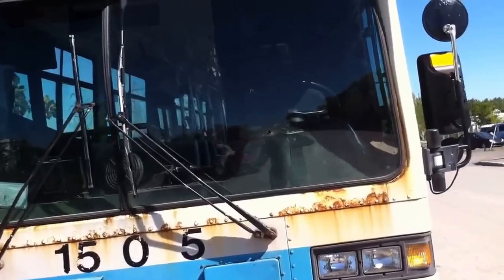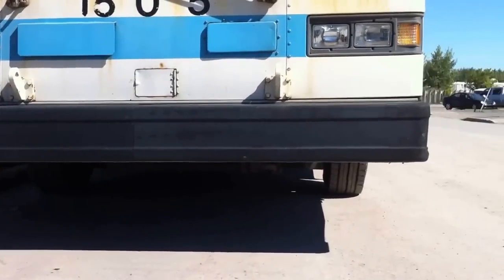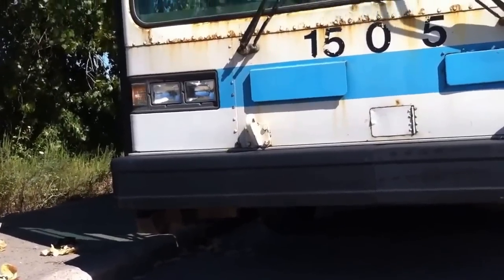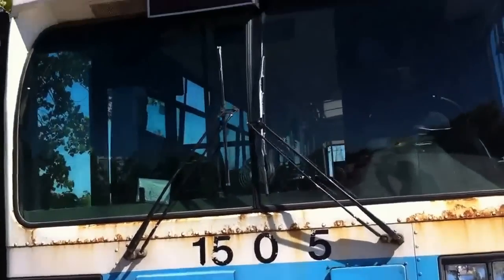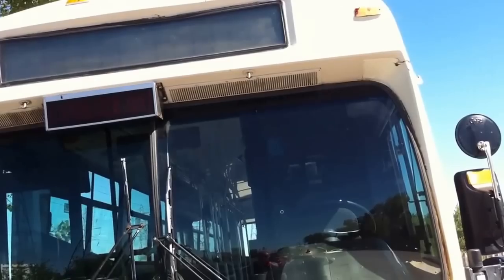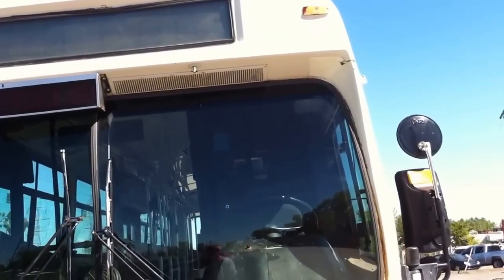The vehicle is also balanced and the wheels are parallel and there's no deformation either on one side or the other. If the vehicle is leaning off to one side or the other, that may indicate a problem of the air suspension. If the air suspension has an air leak in which the compressor cannot compensate, that will be a major defect. If there's an air leak in which the compressor can compensate, that will be a minor defect.